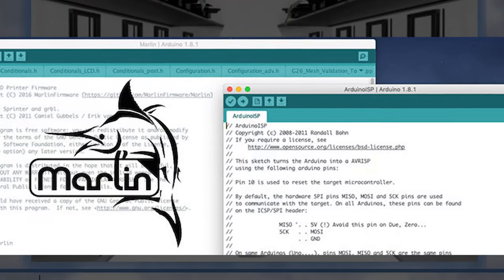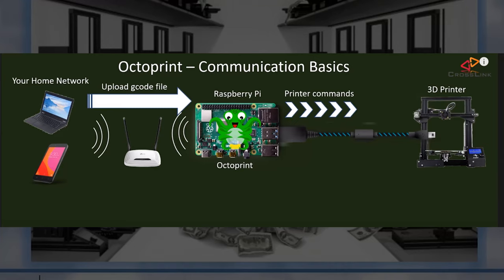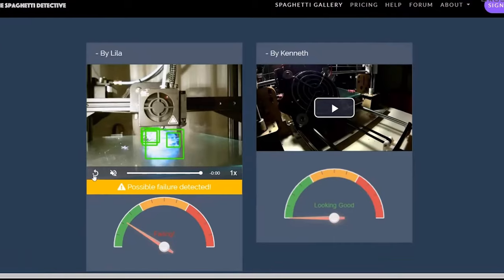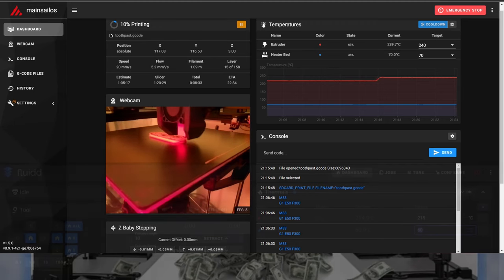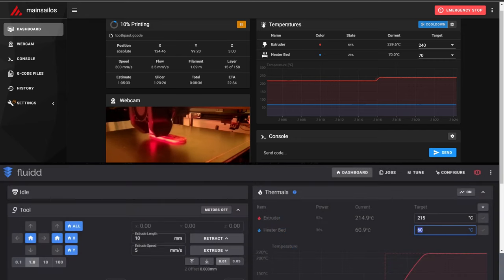Talking about firmware, most machines on the market run some version of Marlin. Marlin, as a mainstream firmware, is very good at making printers print. A halfway upgrade for your firmware would be OctoPrint, which allows you to control your 3D printer remotely and adds many features. But a real firmware upgrade will be Klipper, a rising 3D printing firmware getting quite traction thanks to easy firmware tweaks and quality retention even at higher speeds like 150 and 200 millimeters per second. Running a 3D printer with Klipper through Mainsail OS or Fluidd is a great way to optimize 3D printing time with faster speeds and remote control. In the next video, I'll show you how I rigged up my printers and controlled them remotely, cutting production time in half.